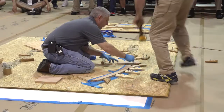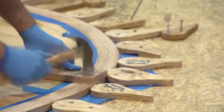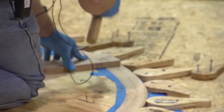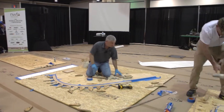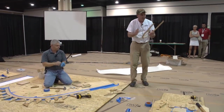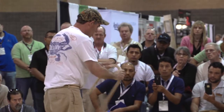You can put blocks of wood across this from your template across to your cam, screw them down, and it'll help hold that overwood down. Make your wedges twice as thick or more than what you've got on the base so you can knock them in and knock them out. You'll get a little spring back, but you can push it back in. Here's a piece glued up — took about three hours to dry. Once you sand it up, it'll look real good.